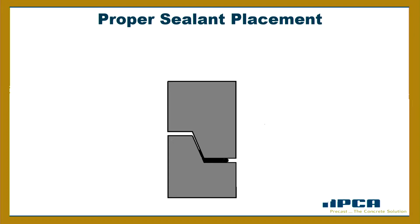So it doesn't do us any good. That should be a good hard surface, all right? If you're noticing that it's flaky and that it's poor, then that needs to be brought up. Say, hey, what's going on here? Because if they're pouring it right side up, that's what happens: the concrete is poured, and then the surface, they're just not finishing it right, okay? So if you run into that situation, let me know or let them know.